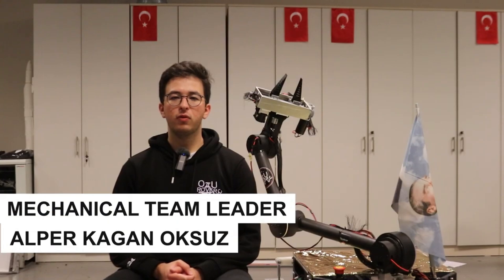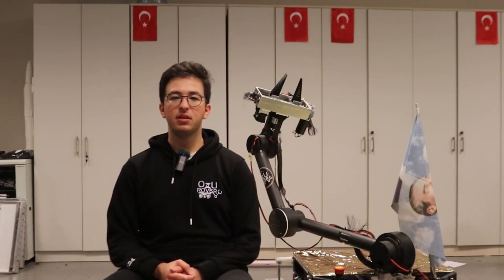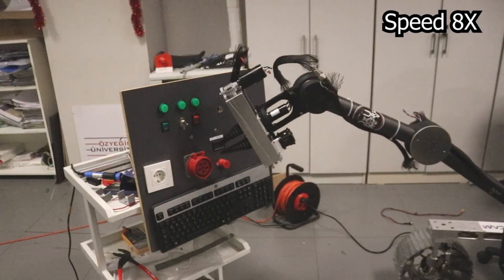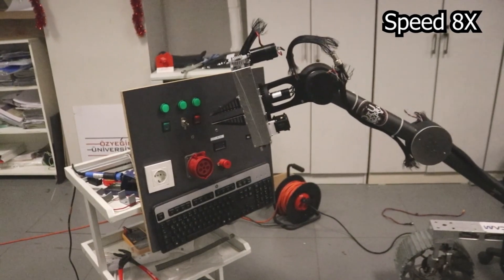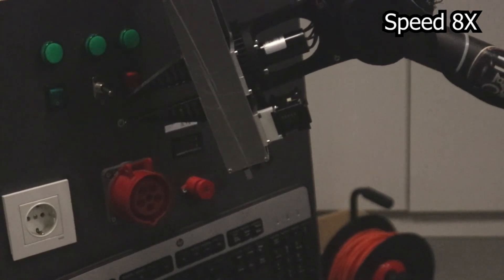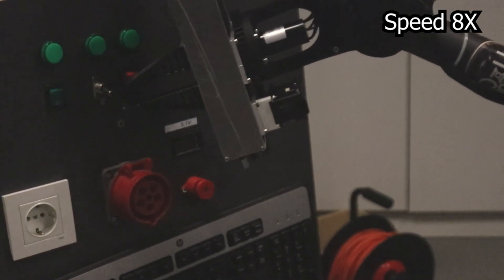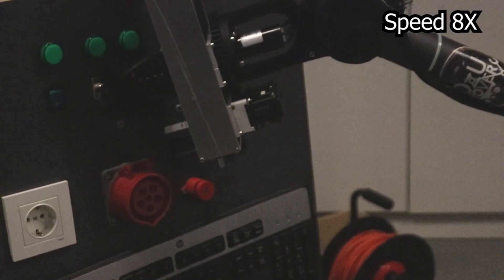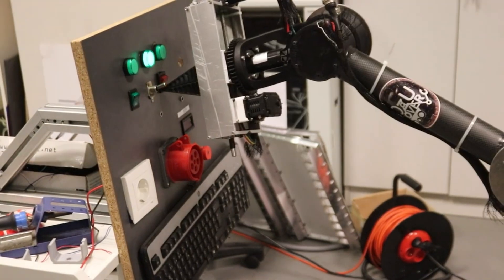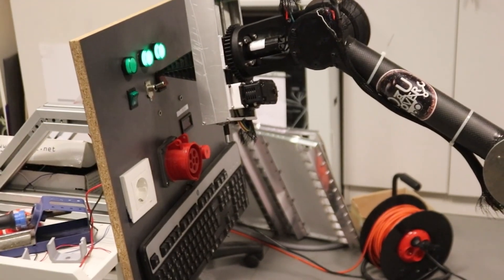This year, a new 5-DOF robotic arm was designed. Brushless DC motors are used for the first five degrees of freedom. Cycloidal gearboxes are designed to achieve the required torque without back-drivability and backlash. Connectors and joints are 3D printed using carbon fiber-based filaments with a high strength-to-weight ratio, and carbon fiber 3K tubes are used as links to achieve low weight. The end effector implements a parallel gripping system with TPU fingers to increase the gripping force area, featuring a slip ring mechanism allowing for infinite rotation.